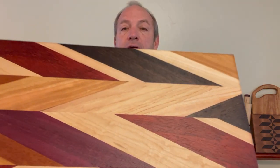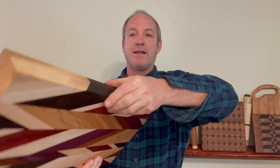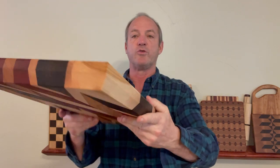Anyways, here is our cutting board. The colors have turned out fantastic. The edge grain gives it a very distinct look. And as you can see, there is a 22.5 degree chamfer on the end, allowing people to get their fingers underneath of it. Beautiful cutting board,